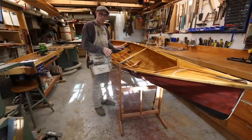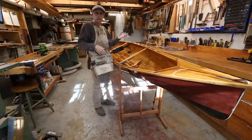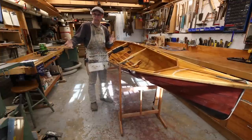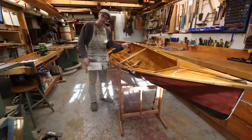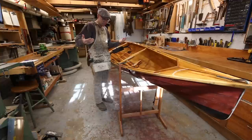It's always been stored under cover outside on racks, well elevated off the ground with a loose tarp over top, on the shady side of the house. It never really gets direct sun except for a few moments in the morning and evening. The funny thing is the side of the boat on the more exposed side has got more varnish degradation happening, and what I find odd is that it's never exposed to UV light — it looks like wood movement is causing this degradation.